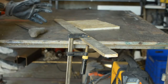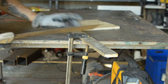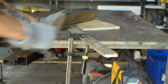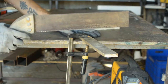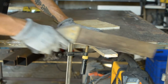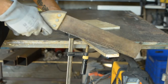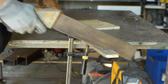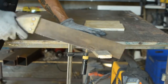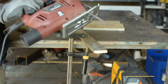When you want to cut wood there are different tools you can use. With a simple saw, you use a clamp to hold the piece — always from the outside part of your bench. You don't try to cut it in the middle; you cut from the outside, or if you don't have a clamp, have someone hold it firmly, far away from where you cut. Then you just let the tool do its work slowly, and you cut through — or you can use the electric saw.